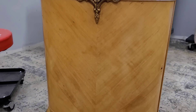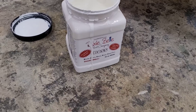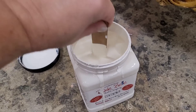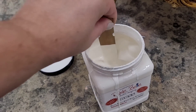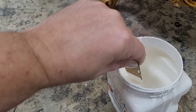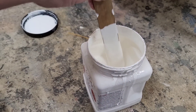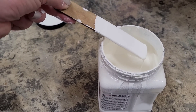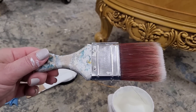I gave it that scuff sanding so it doesn't have a gloss on the finish anymore, but I do plan on using white, so I'm going to prime it using Dixie Belle Boss in white — that's going to give me a white base. Before you use Boss, you want to make sure you stir it up really well. It can have some that settles to the bottom and the chunks can get pretty big, so I use a chopping motion to break those up and stir until I don't feel any on the bottom. I'm going to mix this really thoroughly, smashing any big globs against the side of the container, and then lay on a coat of Boss using my Dixie Belle mini brush.